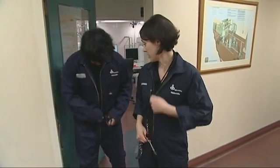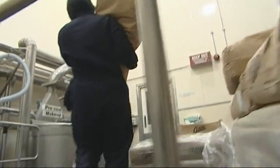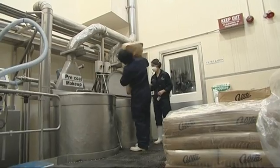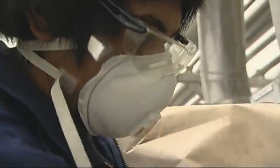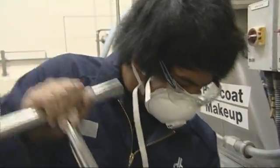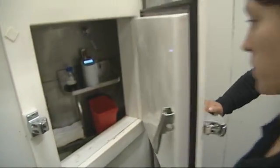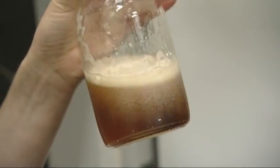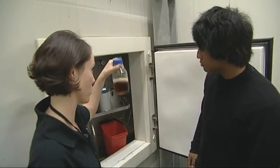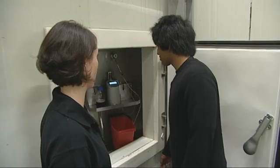We're all suited and booted. Let's go make up the DE ready for filtration. DE is diatomaceous earth, which helps draw off the yeast. The skills you need for brewing are a strong drive for quality — we want to make quality products. You also want to be a fast, effective decision maker because it's a fast-paced environment. And you need to be quite flexible and move with the process. OK, we've finished filtration — we've taken the yeast out. Let's have a look at our finished product. It's looking pretty good — nice, brown, bright beer. Good head retention, good clarity. Filtration's been good. Now let's just check the CO2 content to make sure it's good for packaging. 2.83 — that's good. It's great for packaging. Let's go.